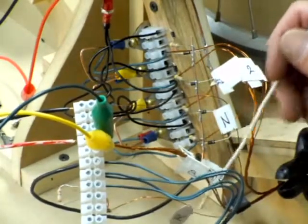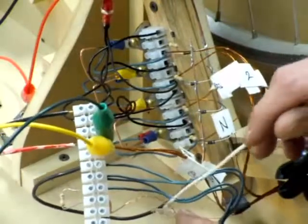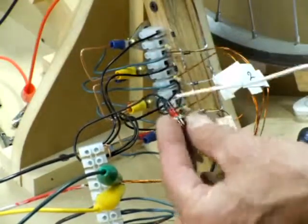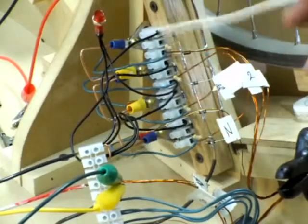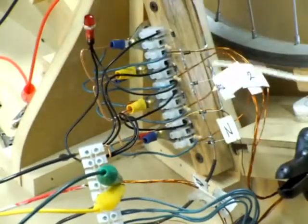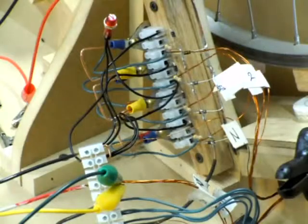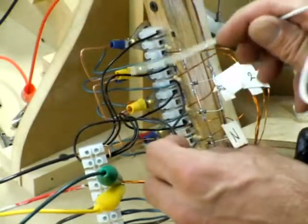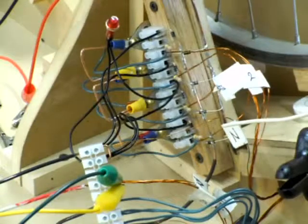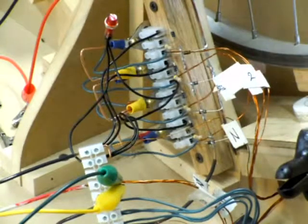This is the resistor side of the trigger coil — that's the beginning of the run on the coil. I've got a safety neon light here, which goes from the collector to the negative. I also wired it so this will protect all four transistors, because you can see all the collectors are connected via this wire here. You can have all these mounted on a big flat heat sink and so forth — that's basically it.